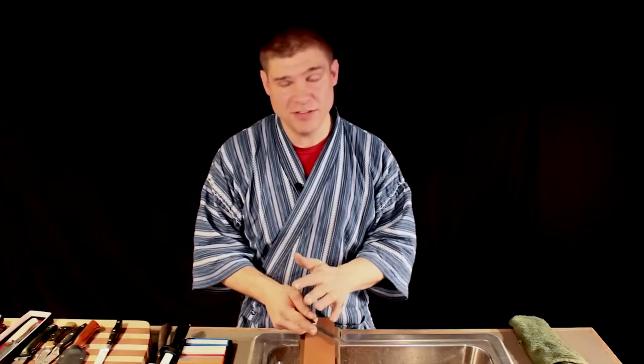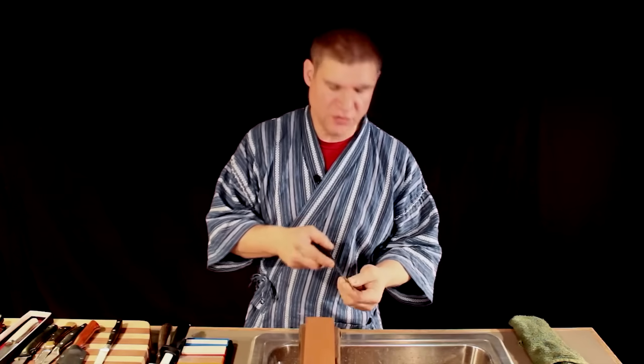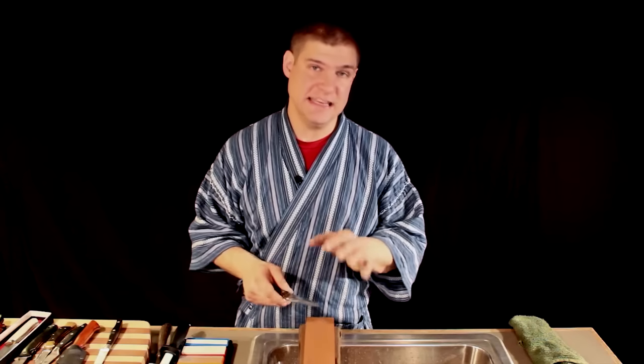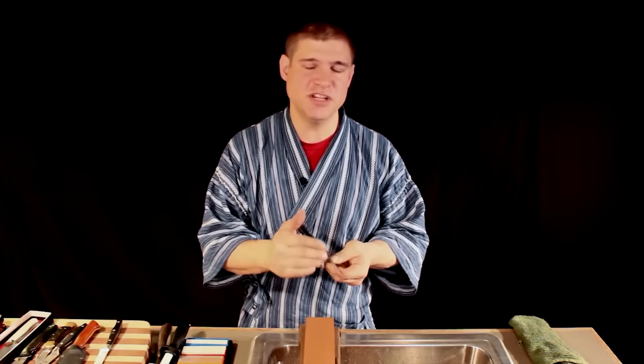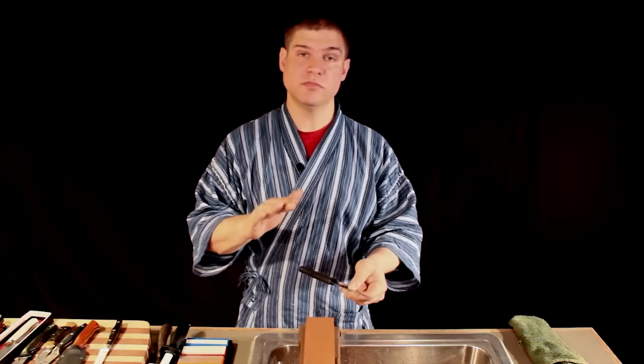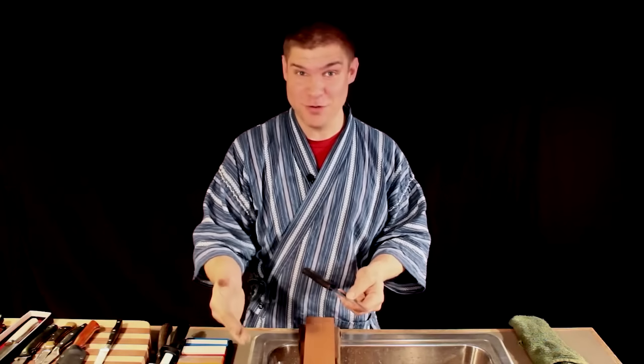After you've spent the 5 or 10 minutes sharpening your knife, when you're using it, take a second to look at that primary edge. See, is it holding up to repeated use? If you start to see little dimples, little waves in the edge, or heaven forbid, any little chips in the edge, you back off, say, oh, I finally crossed that threshold where I've actually gone too thin. I challenge you to do that. Go too thin. Almost nobody ever does.